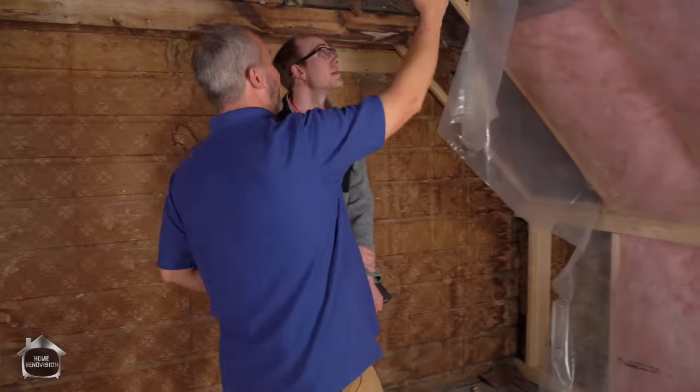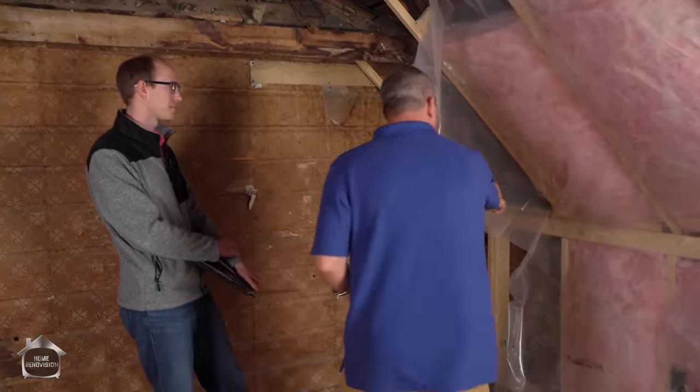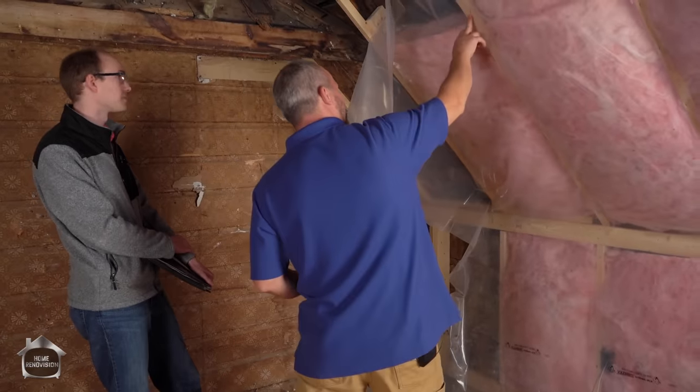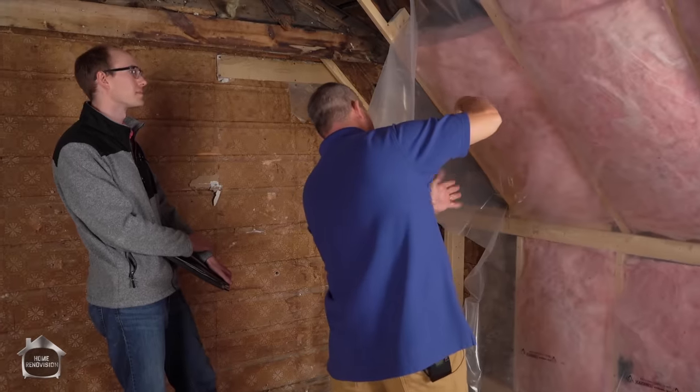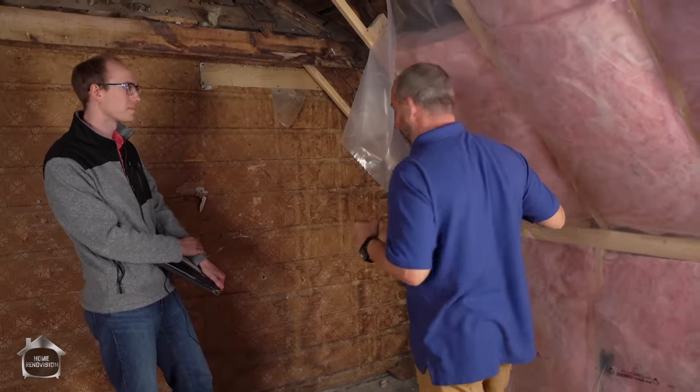Or we could maximize a little bit of headspace and get more of a nine or ten foot ceiling here with something a little bit simpler. I'm going to probably look at both options just because I'm curious. And is there anything — like what we're doing over here — we're basically adding wood so we can get proper insulation and we want to go to R20. We're adding this 2x4 and this 2x2, actually cut on a 45 so that all of this downward force is sitting against that wall, just trying to give a little bit more rigidity.